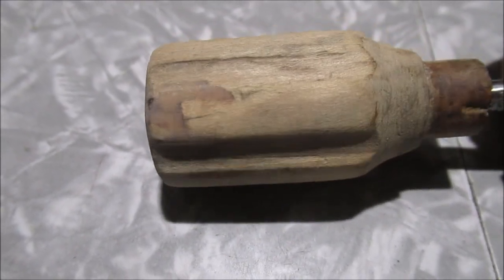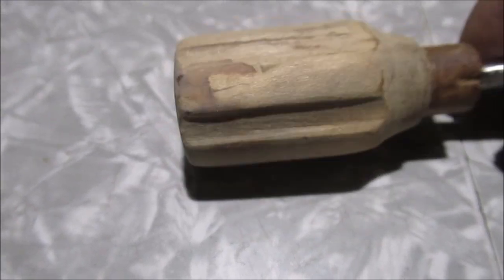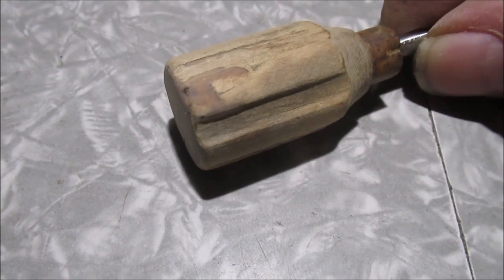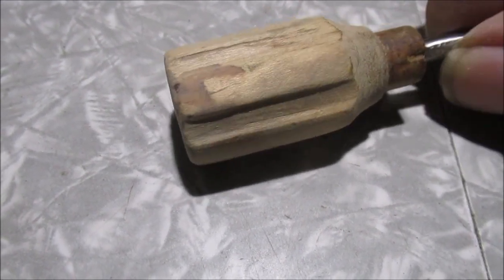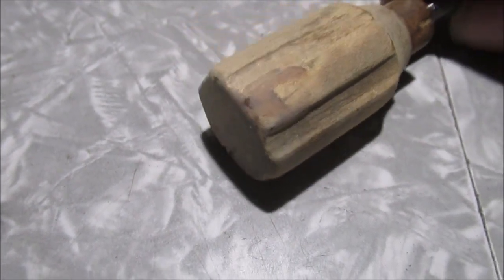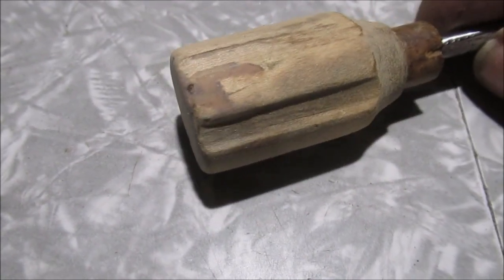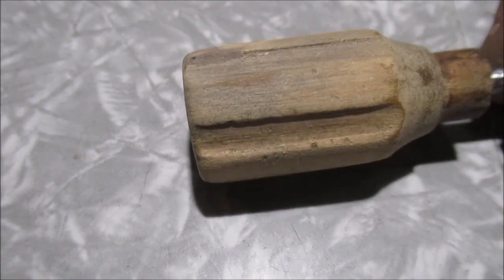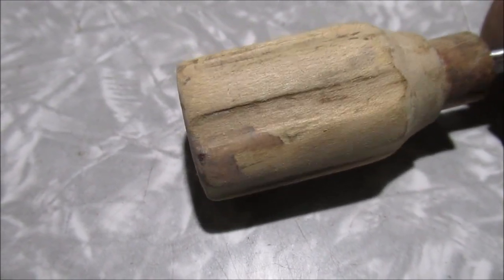But I'm painting it. I mean, this is more than 2 hours since I put the epoxy in. It takes a while for that stuff to really super harden. But catch it at the right time. You can take it off with like 80 grit sandpaper to smooth it down and work your way as it hardens.